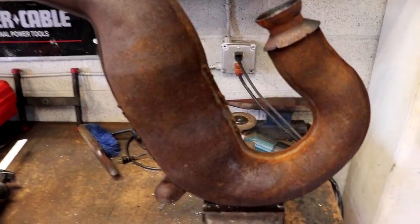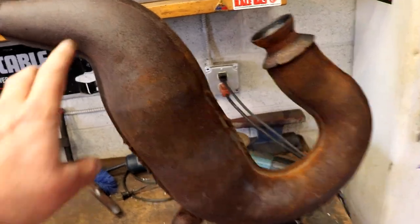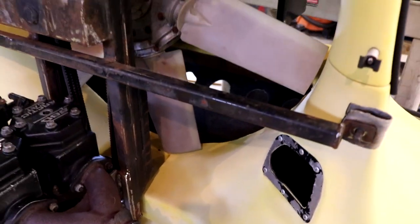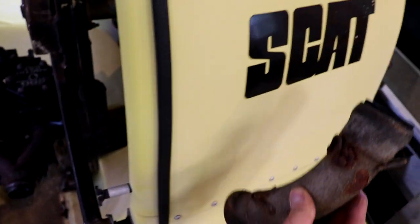Well, I want to use this portion and this portion, but I need them to be flipped in order for the exhaust to exit where I want. On this vehicle, I want this exhaust to come right here and run on the outside of the fan shroud, because it used to run in there. And in there's no good because it blocks some of the lift. That affects speed. The goal is getting the exhaust to come out and around and up the side and out the back.